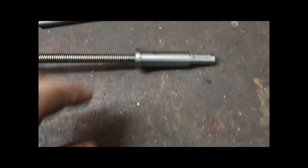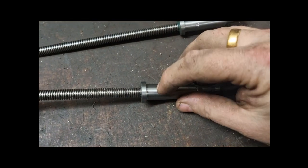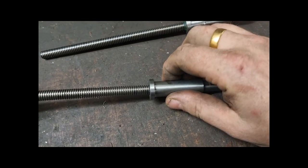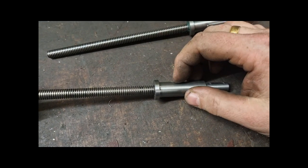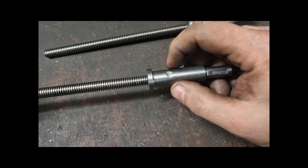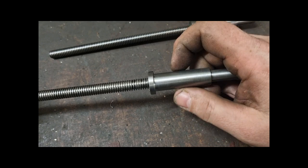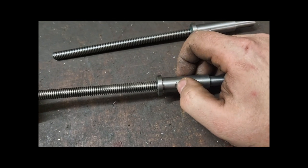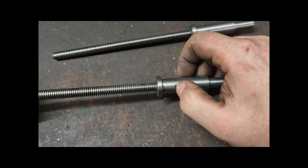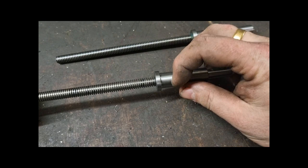So I've got the grinder, Dremel, and I basically scalloped both sides, and then turned, and then when I was getting close again I scalloped again, so it's not that much of an issue, and it's a bit of a benefit doing it that way anyway. You won't see it, but when you grind it you'll put a burr on the top of the pin on both sides, so there's no chance at all of that pin slipping.